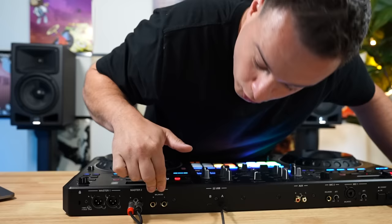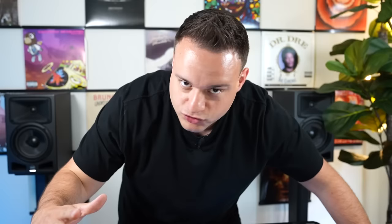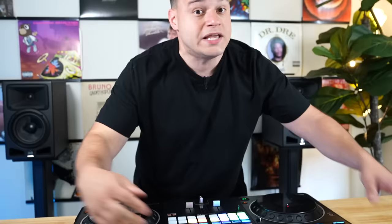Let's start with ports. You've got your two XLRs, your two master RCAs, and your two balanced booth quarter-inches. Super standard, but this makes it where you can use this in any professional setting — you've got the right outputs right here. Two USB-C outs, so it is a dual sound card, easy for switching with DJs, which is super clutch. And obviously we're in 2023 now, so we've got USB-Cs all over the place — but not just to hook up your laptop. Also a first: this is actually USB-C powered. It does come with a power block, but theoretically you can use your Mac or Windows power if it's USB-C. So if you happen to forget your power cord, it's a lot easier to find a USB-C rather than some special plug that they usually come with.